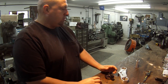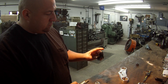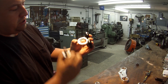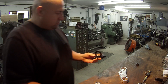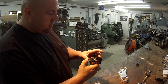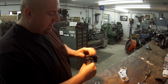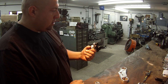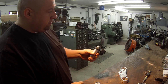I made a little jig a while back — this is a piece of aluminum I turned. How I do the milling, drilling, and tapping is that I machined a little register here to fit this machine register. It'll sit on there and fit that machine register. I'll get a washer and one of my 5/8 flange nuts, pull it down tight. We'll probably hold this in the vise using a V-block, get it squared up, and do the milling, then the drilling and tapping based off of our centerline.